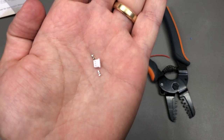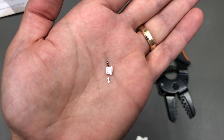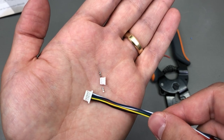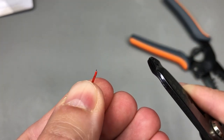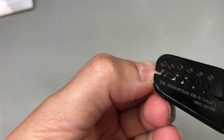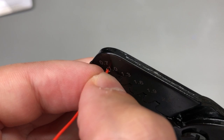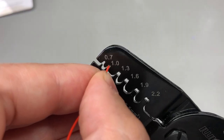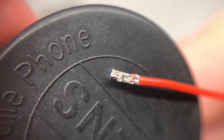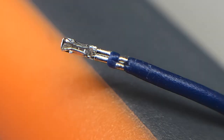And now the pièce de résistance — some JST-SH connectors which are just 1mm pitch. Very small crimps that I use on my Qwiic connectors. I'll typically get these pre-crimped but sometimes you need a custom cable. It was very difficult to fit the tiny crimp on the 1mm die as it slides around, but I managed and successfully crimped the wires. Crimping the insulation on the same 1mm die was slightly easier, but the result isn't great because I stripped too much insulation — the wires stick too far forward into the connector. By comparison, a factory crimp shows the wires don't stick out. But the important takeaway is that the tool can do it — it's just a matter of practicing.